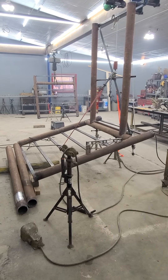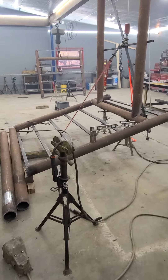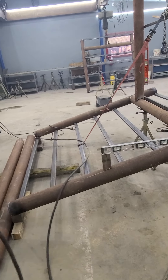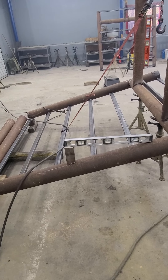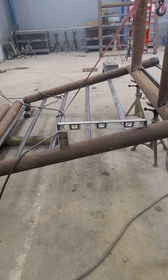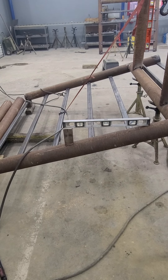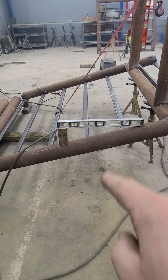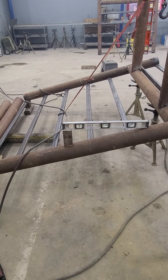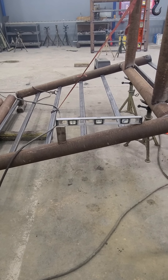You'll probably have a hard time telling what the hell that is — it's upside down right now. The roof's gonna be a 3/12 pitch. A little trick here: if you're setting something like that, I cut a block of wood at six inches right there, six inches in the two-foot, and level right there puts me on the angle that I want.